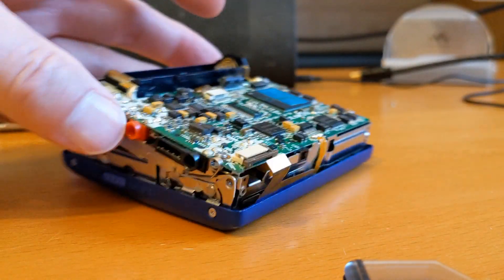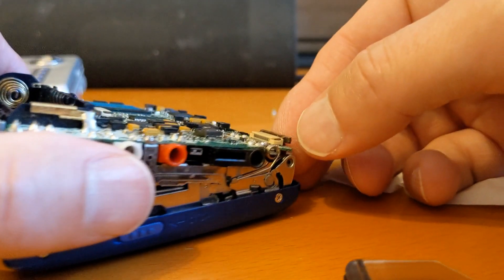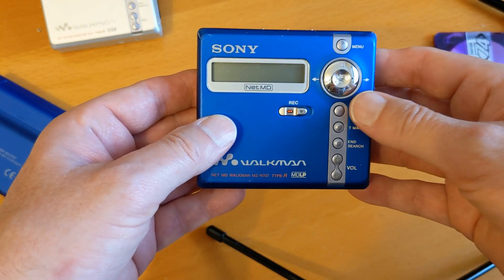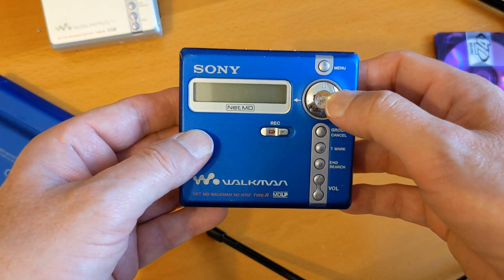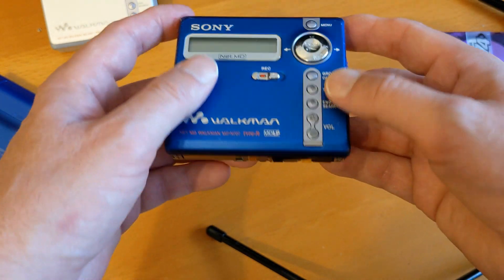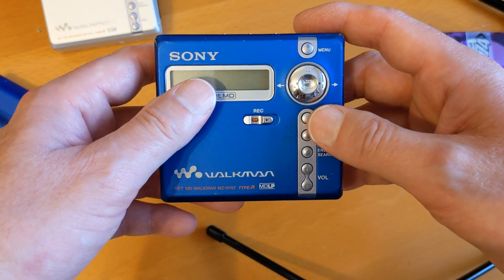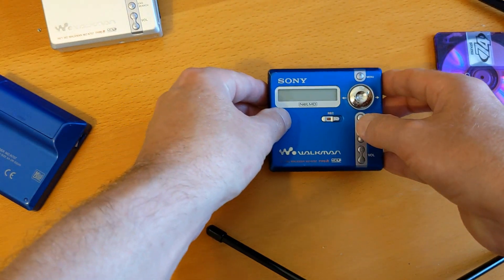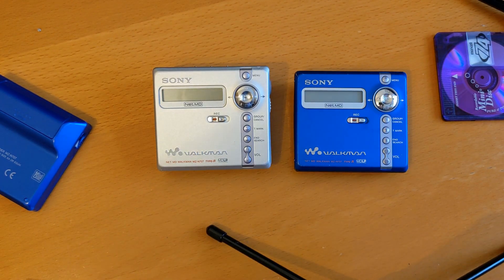Now I'm going to put that back in - just push it back in there and close the clip up like that. So that's what I suggest you do if you've got button presses that aren't working at all or they're giving you weird results, like you press forward and it pauses or something like that. I think - and I can't prove it - but I think that is the problem that causes those symptoms. Thanks for watching, and if you can test yours to see whether it needs one button press or two, please do and leave a comment to let me know. Thanks a lot.